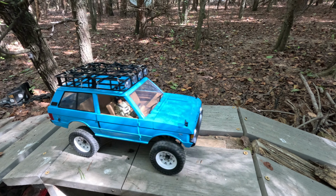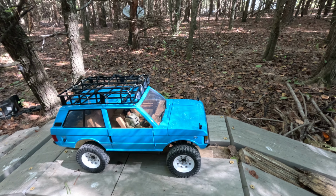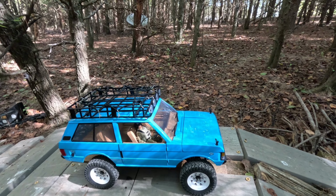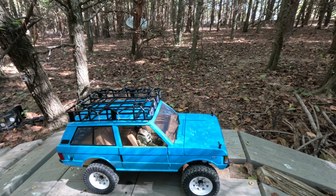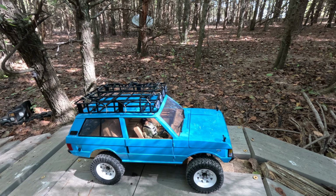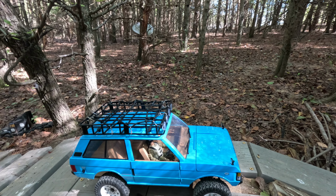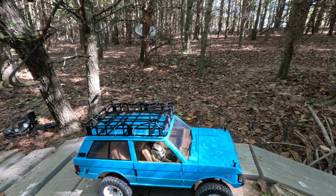Anyway, this seems to be working just great. And it is lipo ready. As soon as I plugged in a 3S lipo to see if it would beep, it beeped 3 times. Of course, when I plugged in this 2S, it beeped twice, so it's all set up for lipo. The nice thing is it has a switch on the side of the ESC for your brake settings.